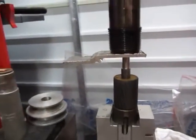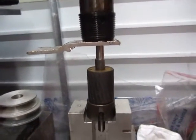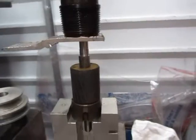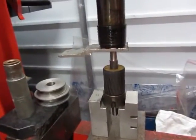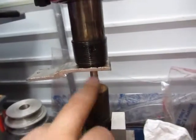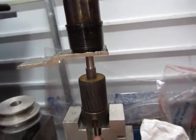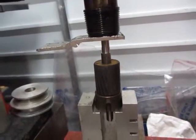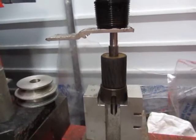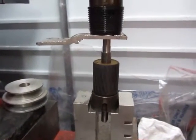This is how you press motor shafts together. They do this in factories on a bigger scale — they probably have 50 ton presses doing this — but this is just at home. This is my facility to press small induction motors together so I can change the shaft profile. I can put a different shaft into this rotor and then the motor will be able to drive a different object or item than it was originally designed to do. That's how you change the motor shaft.